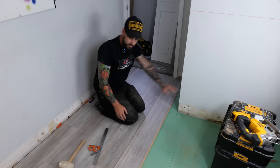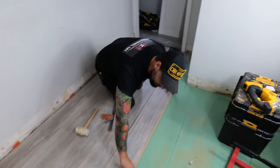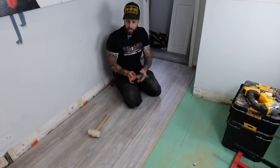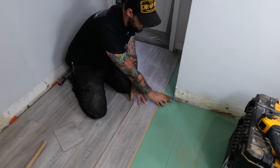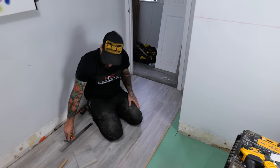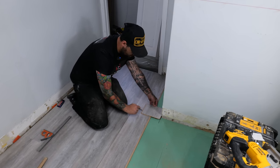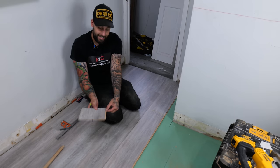We've come up to a corner - these may look intimidating but they are very simple. Put a piece of laminate on top of the row before, lined up with the plank we've got there. Use your combination square and an offcut of laminate - put the square on the face of your laminate, come about five to ten millimetres short of the wall and mark across the front. Then take your offcut, sit it against that wall and mark it. That gives you the exact cut measurement minus ten millimetres because of the clip - a perfect fit.